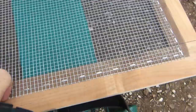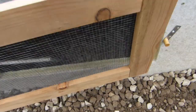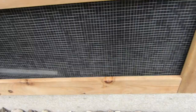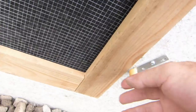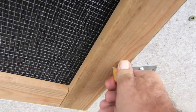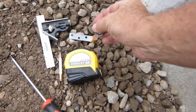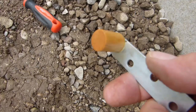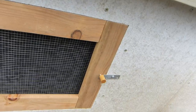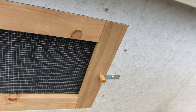I've got the screen put in here — nylon screen backed up by quarter-inch hardware cloth and a million staples. It pops right in there. I looked for a toggle or turn but couldn't find any, so I made my own. All I did was take a quarter-inch zinc mending plate, screwed on an inch of dowel onto it, and put some construction adhesive on there. I think those work okay — critter and bug proof.